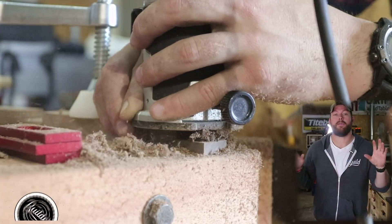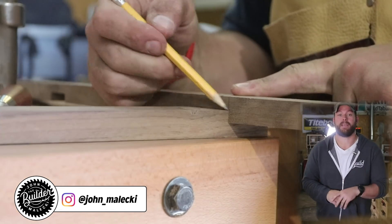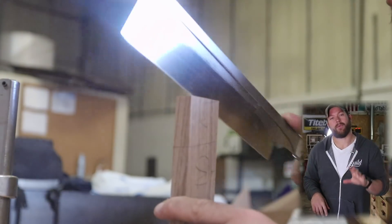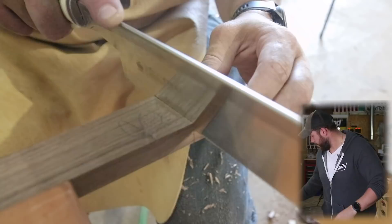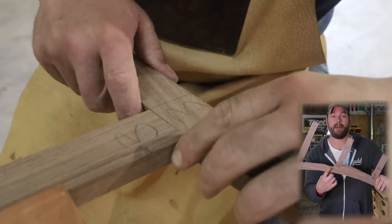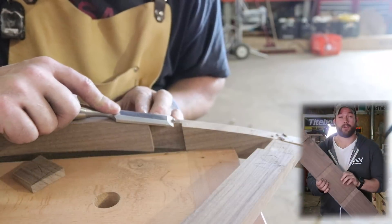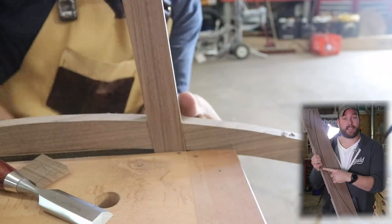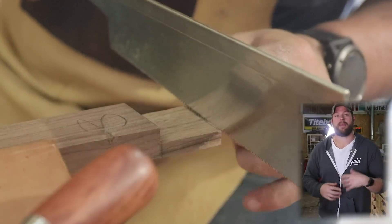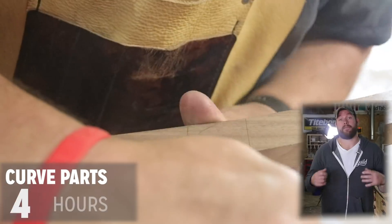If you follow me on Instagram, you'll know that at this stage I ran into a bunch of hiccups and I cut the curve in the joinery three different times. My initial plan was garbage — I tried to use a template to route but it was too thin and I ended up jumping the router around and ruining the part. I then tried to dado all the joinery first and cut it on the CNC, but the CNC skipped out and ruined that one too. I settled on cutting the curve on its own and then cutting all the joinery by hand. All in all, this process took about five hours.